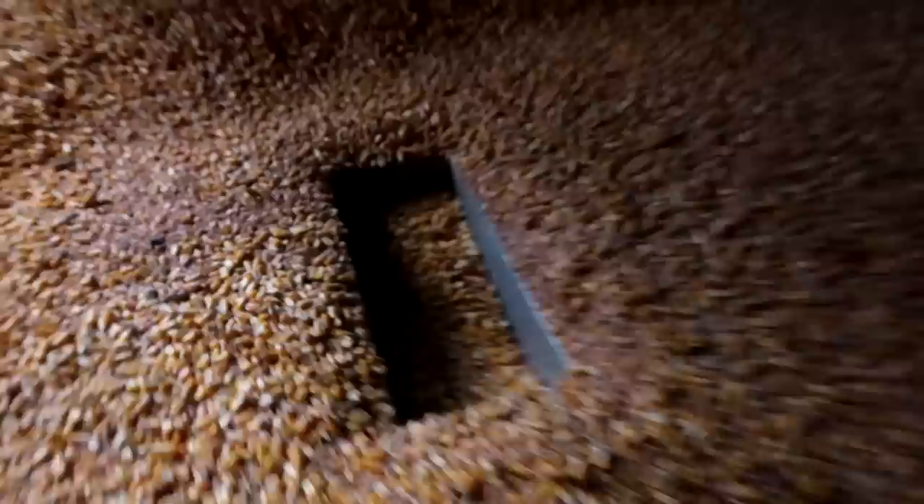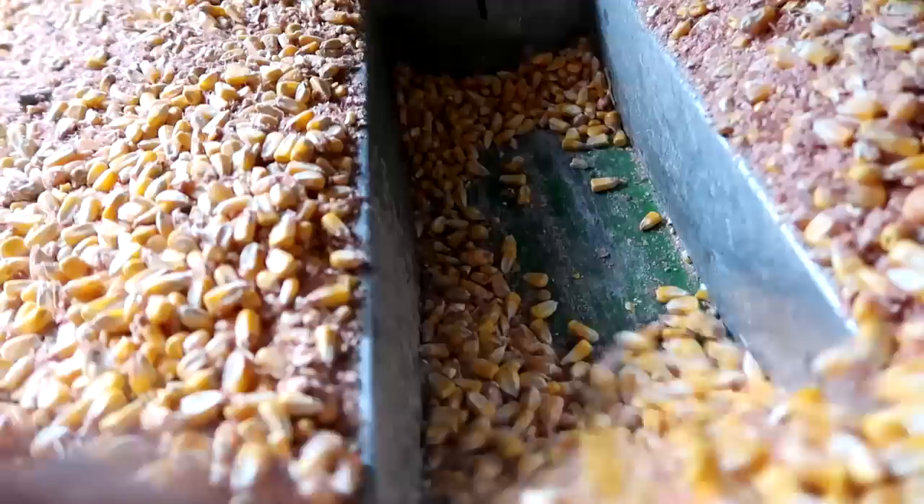What's going on here is that the slides we use to open up the floor and let the grain go down to get into the auger — one of these center ones is broken. It's not actually sliding closed, so this is always open. Where this one, we can slide it open and shut. You can see the green slide that stops the corn from getting down to the auger. Sukup, which is the manufacturer of this bin, has a really easy way to attach these slides to this shaft using a collar with a set screw or set bolt.